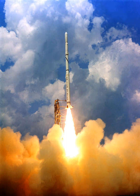Stage 4, Altair. Gross mass: 275 kg; empty mass: 37 kg; vacuum thrust: 22.24 kN; burn time: 28 seconds; diameter: 0.2 m; span: 0.64 m; length: 2.53 m.